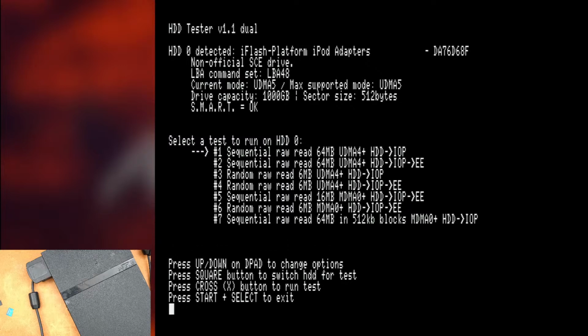But yeah, as you can see, we're back to the PNY, it's detected as it's supposed to be and works reliably. So my hope at this point is that right now the SanDisk is the only microSD card you can find on the market that's over 1 TB. I'm hoping that in the next year or so, greater than 1 TB cards become available from other manufacturers that are not necessarily using this Micron memory that the SanDisk card is using. If other cards come out with memory from different manufacturers, like if Samsung comes out with a larger card or something like that, then I suspect it's going to work reliably with this.